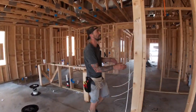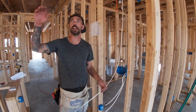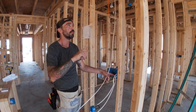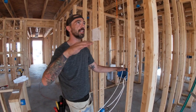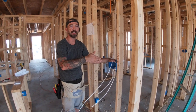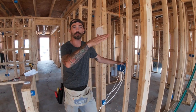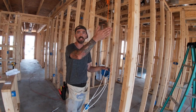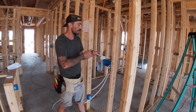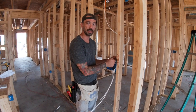Talking about switch secrets — you might want to come up here and have your first switch as the family light, your second switch as the fan, and then the dining light. But I don't want to set it up so I've got family light, dining, then fan — because the fan is always on the back end. So what I'm going to do is make my dining room switch leg the first switch, because it's not wrong — it's still an immediate light and just as far away. I'll run my fan light after, so I'll have dining in my first position, family light in my second, and family fan in the last one.